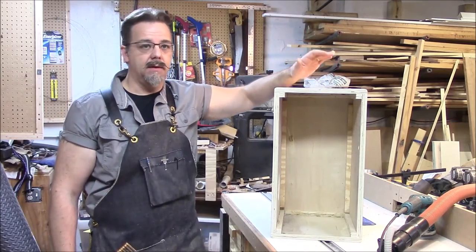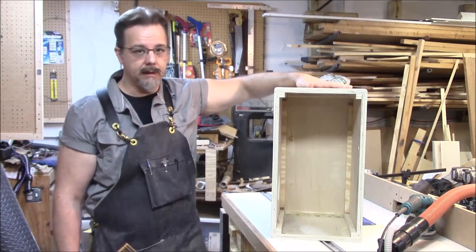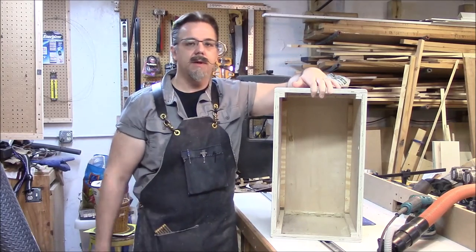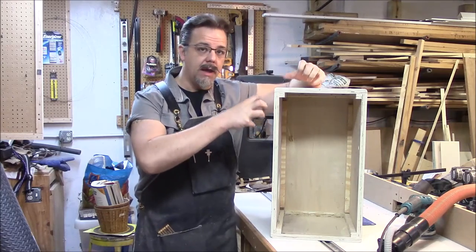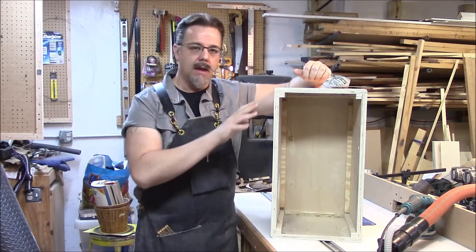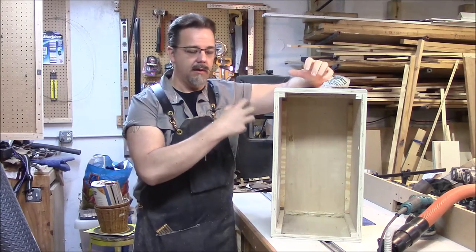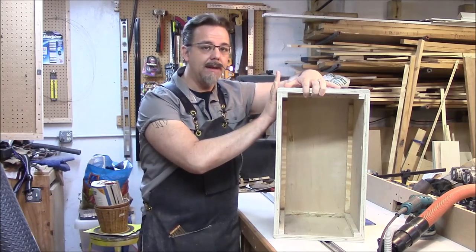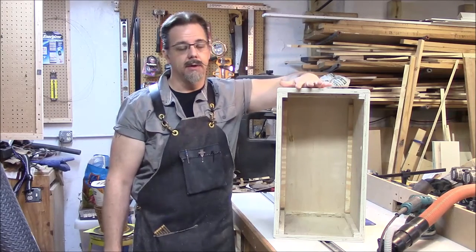But this is going to be a musical instrument, and there's very likely going to be some drinking going on while playing. There's a good chance alcohol may be spilled onto this, and I don't want the finish to be easily marred by alcohol — so I'm going to be going with a water-based polyurethane. Since it's water-based, wood fibers tend to absorb water and expand, giving a fuzzy appearance. So I want to wipe it down first and then sand it with 220 after the grain has raised. That way when I put on the water-based poly, all the fibers that would have swelled will have been sanded back and it'll look much smoother.